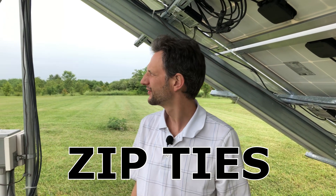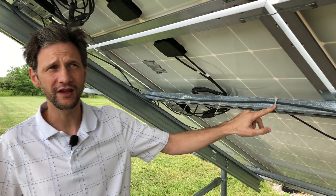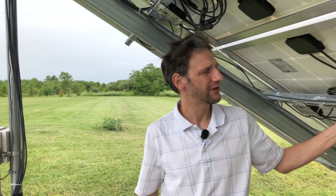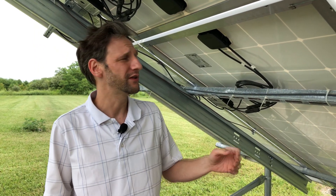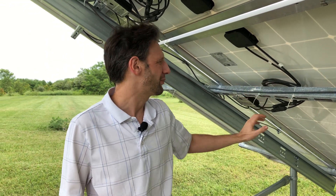Another great suggestion from the comments was related to zip ties. I used these zip ties for wire management, which is really handy. However, some people commented that they aren't UV stable. I was out here the other day and a zip tie around one post actually snapped off — it gets more sunlight — though most still feel pretty strong. Clearly they aren't going to last 30 years. They do make a UV stable version, and I'll put a link in the description. I'll probably come through and replace them all with UV stable zip ties. You can also use metal clips — some were provided with my system. They slide onto the panels and metal channels as stainless steel clips and hold the wires, though they're not as flexible if you want to package things neatly.